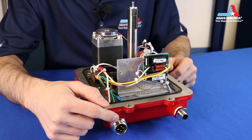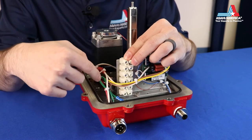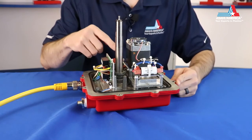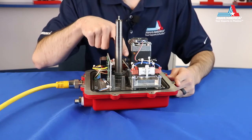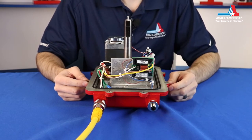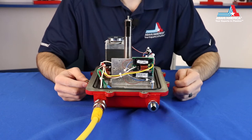Here we can see that the power wires from the TUR connector run through to the travel limit switches. In most units, the power wires will come through an open conduit and land on our terminal strip before running out to the travel limit switches, then through the limit switches into the capacitor and finally into the motor. When the actuator reaches its full open and closed positions and trips the limit switches, power is diverted from the motor and capacitor to the RHM. This provides power to the heater and will trip either the closed or open relays, allowing you to provide feedback to your PLC. The closed or open LED should also be illuminated. Power must remain on the actuator after the open and closed positions are reached in order for the RHM to operate.